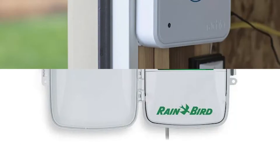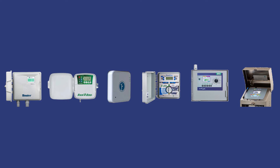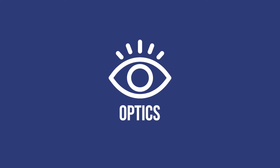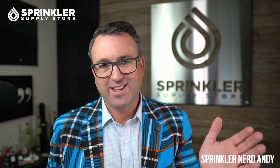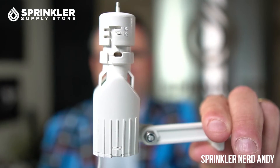When we talk smart controllers, we're talking Hydrawise, Rain Bird IQ, Rachio, Weathermatic, Baseline, CalSense — all of them. You should have a rain sensor connected to the controller, either wired or wireless, for the best performance. Not to mention optics and public relations: you do not want to be seen watering in the rain, and the only way to prevent that is to install a rain sensor.